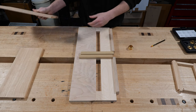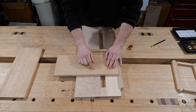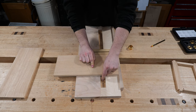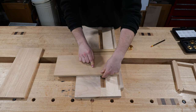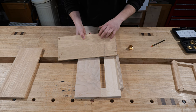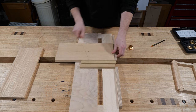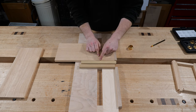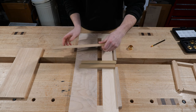I don't have a table saw in this workshop but I do have a bandsaw and a planer thicknesser, so I chose to make this from birch plywood — I could cut it on the bandsaw and then run it through the thicknesser to get both edges completely parallel. The jig has two sections: if you use the same side for both cabinet pieces you'd end up cutting the groove through the front, so by having two sides you come in from the back and the guide bush stops at the front.